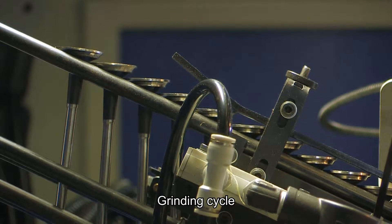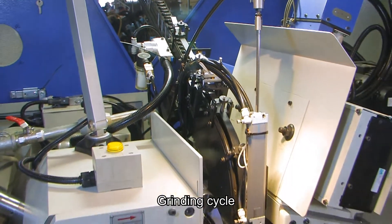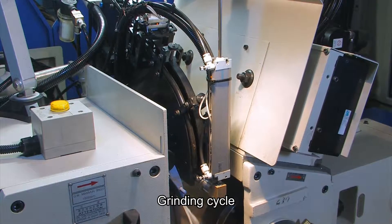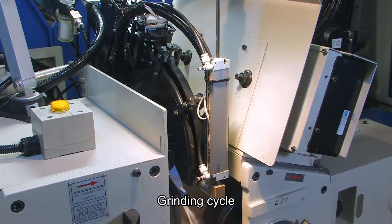This machine was designed for grinding valve stems as a special grinding machine. The special feeding mechanism is applicable to a certain range of valve diameters for automatic loading. This device contains 14 sensors that can completely avoid the valve or any unexpected situation arising from safety issues.